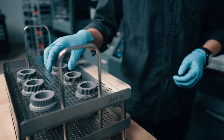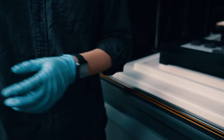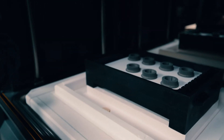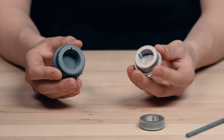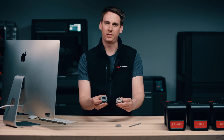With the brown part correctly positioned in the furnace, it will be heated in a sintering cycle, which is fully controlled by Fabricate. During this heating process, the remaining binder is evaporated and the metal particles fuse together. As you can see here, the part is going to shrink by about 15%, due to the metal densifying in the furnace.